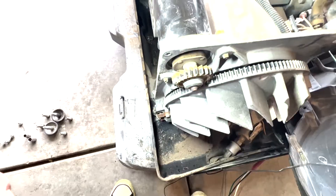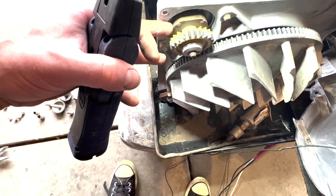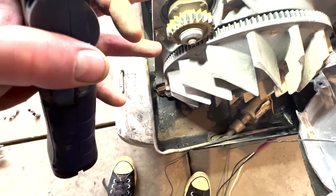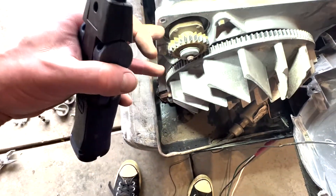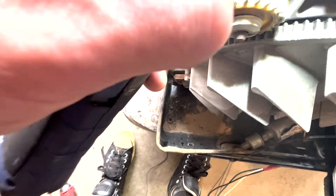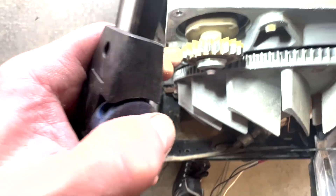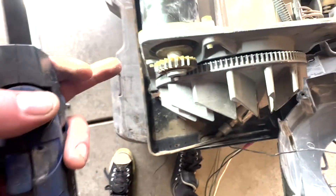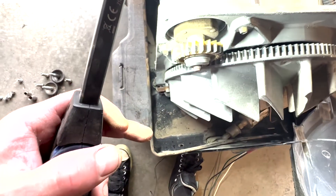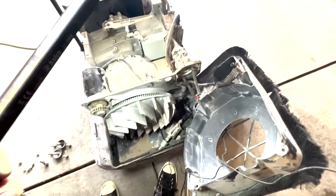It's interesting — in a typical automotive starter, when the solenoid engages, this gear gets flung out and goes until you disengage the solenoid, then it retracts. This is a little bit different. I'm wondering if this retracts automatically when this starts going, but mechanically — not electronically controlled — because of the opposing force. I don't know, it's a little bit different design, kind of cool.